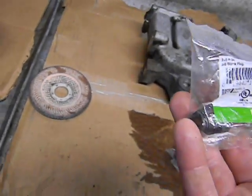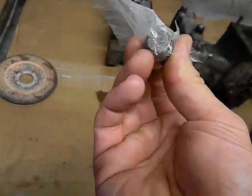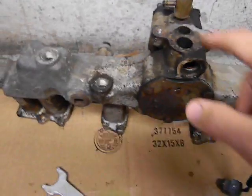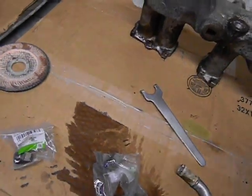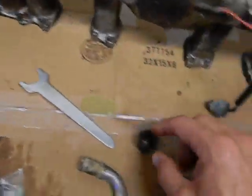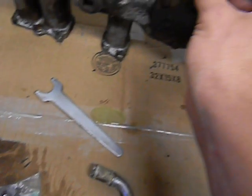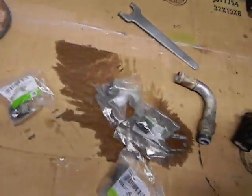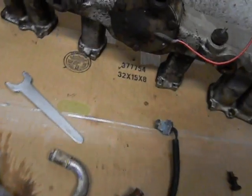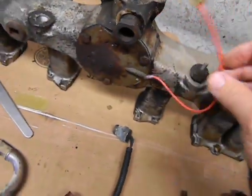I got plugs from Menards - it's a 3/8 pipe thread fit - and I'm going to plug all those ports off. For this opening here I'm going to make a plate. This is where the choke tube comes down from the exhaust, which I don't need either. I'll put a washer there and weld it up. I cut the gasket out and I'm going to use that to block it off. Then I can paint the whole intake. There is a pan heater on the bottom that may help for cold winter starts if I decide I want it.